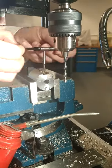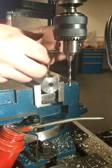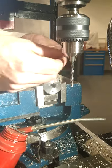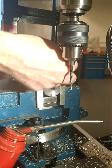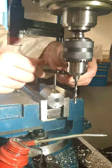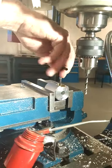And you're threading forward, and it's quite easy to do, just ensuring the tap is perpendicular into the hole. And you're threading back out of that. And threading back, and back out again. And twisting forward, right down to a stage where you can feel as far as you can go, till you start coming to the bottom of that hole. One full turn forward, a quarter turn back, and we can feel the tap has now reached the bottom of the hole, so that's as far as you're going to go. Reverse back out again to ensure you remove all that swarf out of the material.